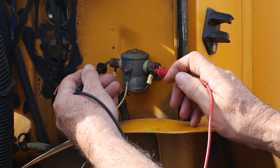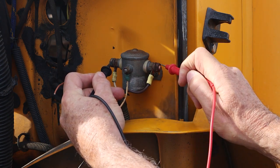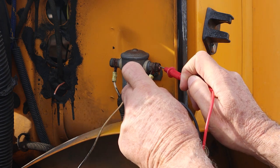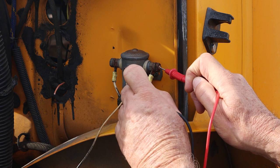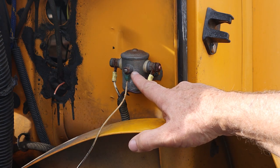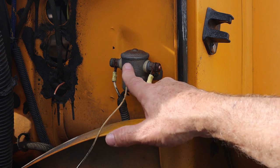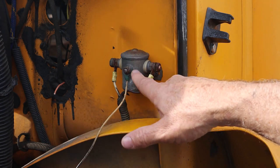We're checking to see if the solenoid is shorted to ground — and it isn't. Notice we have no continuity between those terminals. Let's check between there and there — okay, that isn't shorted to ground. Now checking this side — notice there's no continuity on this side. But if you hear the beep — looks like this solenoid is shorted out somehow. As you can see by touching the meter to this terminal and that terminal, we're getting a connection that's not supposed to occur. We're only supposed to get a connection when this solenoid is energized, so it looks like this solenoid is shorted out.